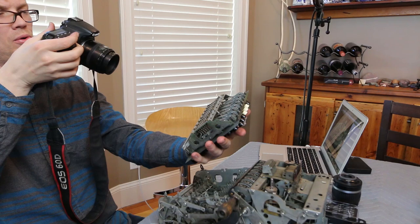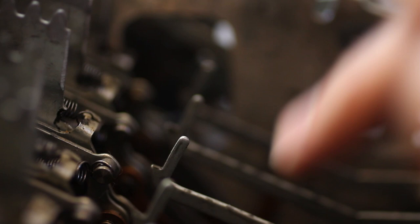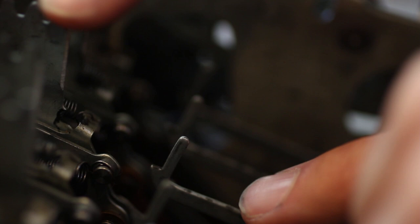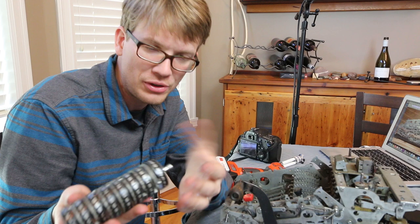I got it! I figured it out! When you push down a number, two things happen. One, that depression will push down this lever a little bit, and that actually allows for this thing up here — the gear that actually turns the number wheel — to actually start moving. How much it moves is a question of which key got pushed down. Whichever button is pushed will actually block that at a certain point. If nothing stops it, it will go all nine, and you get nine. If it stops like halfway in the middle, then it stops at five, and it'll only count five. So this oil that I have in my fingers right now was put on here by someone in a factory in the 1930s. The numbers are somehow responsible for the digit carrying. I'm glad I didn't have to manufacture these things for a living — I would have not been good at it.